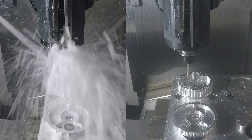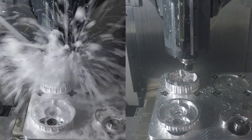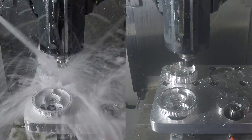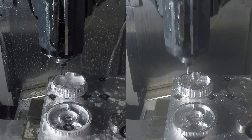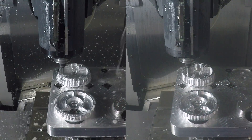We're drilling some 1/4-inch clearance holes, and these are the number 7 holes. And now we're chamfering — this is a 1/4-inch 4 Flute Lakeshore Carbide Chamfer Mill.